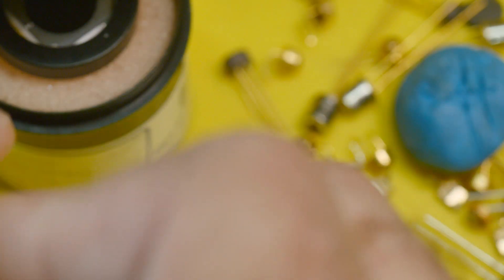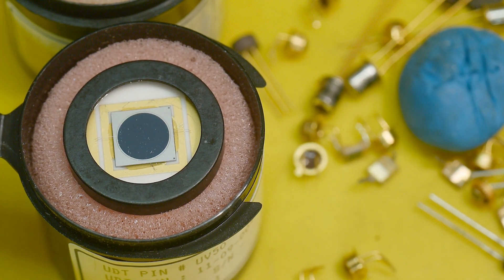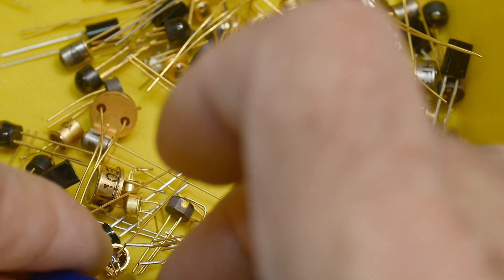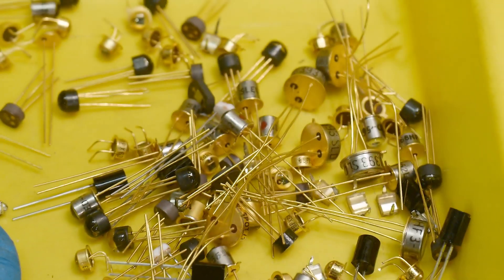These are UDT — really high-end expensive photodiodes. Here's another one, a little bit smaller. I think these are actually one square centimeter in area. You want to know the area because it's microwatts per square centimeter, and you need that in your calculations — they make these in even units to make your math easy. This one is not silicon, it's indium gallium arsenide or something similar — it's sensitive to infrared light for fiber optic use. But most of these are all silicon. All right — chip of the day: photodiodes.